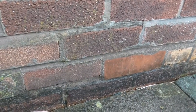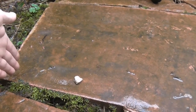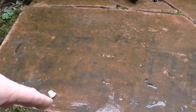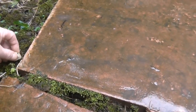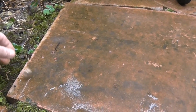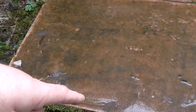For something down at ground level it's different. These flags I made myself — literally pieces of ply stuck into the floor, then I made up the paving in situ. Anything near the ground needs a stronger mix, meaning less sand. This was a two to one mix — I mixed in some gravel for extra strength and used the mortar plasticizer. Look at just the edge of this — it's tough as nails. Mortar mixes low down like this should be two to one.